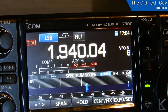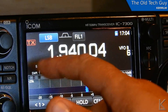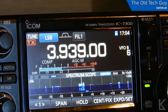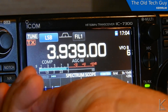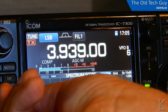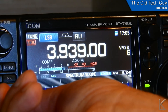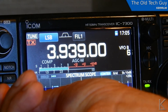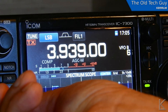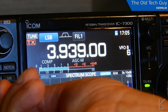I did do a radio test. I had the antenna hooked up to the radio and was talking to some guys on 75 meters. Steve was about S9 here, and he gave me a similar report — he said I was about S8. He's in a city about within 200 miles. He heard me just fine at 20 watts and said I was about S8 at 20 watts. So it definitely works on 75 and 80 meters.